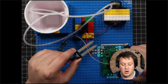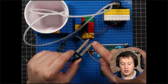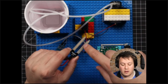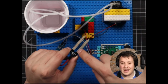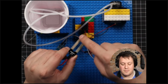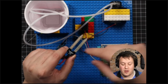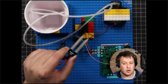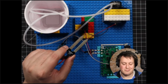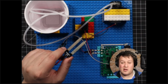So we're using some of our nylon conductive tape, which we've used in other places, just over the top of here because it conducts really well. And so we don't submerge this entirely in the soil. We just have some clean copper up top. Basically, we have a changeable conductive surface we keep adding on over and over again. These get kind of gross, so peel it off, put another piece on, you're good. And it saves that $4 sensor, which is the number one issue. They're cheap, but they also crap out on you really quickly. This is just a great way to keep it working forever and a day.